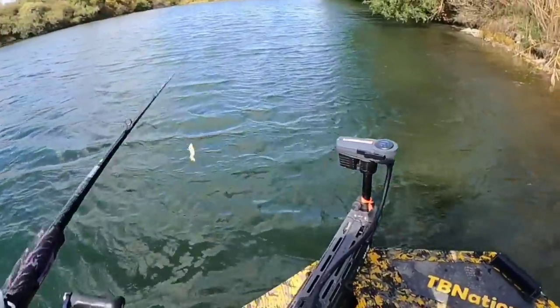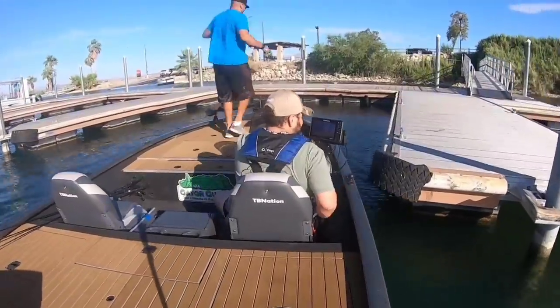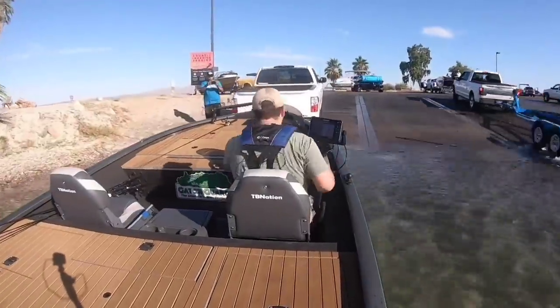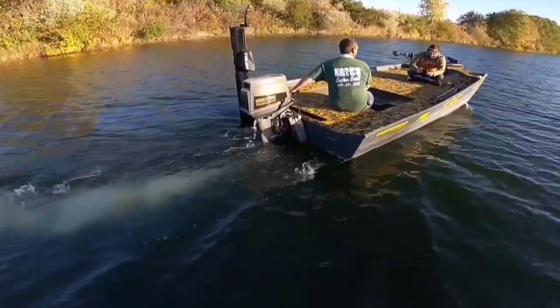So if you're wanting to put these kits inside, say, a bass boat — I know a lot of people keep hitting me about 17-foot trackers, 18-foot trackers, bigger boats with higher horsepower limits that go faster — that's where I think 1/16th starts to get a little eh. Even in that Tracker V18, I stuck quite a bit of one-eighth inch angle for the crossbeams. I use 1/16th in there a lot, but not all of it, and that's simply because that boat goes fast. It cooks. Compared to a smaller boat with a 25 or 15 horse, it's only going to go between 20 and 30 on average.